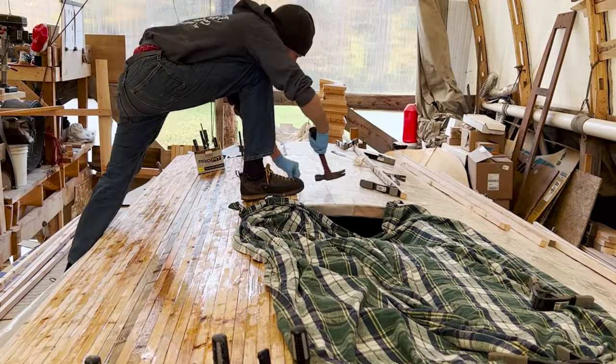Now that it's all kicked off and warm in here, we'll fair the top, flip it over, fair the underneath, and we'll fit it and fiberglass over it. Because of the prep being flat, flat, flat, it made the process of gluing up yesterday pretty straightforward. Oh, good. Okay. No, the glue up itself was easy. Yeah. The temperature right now, that's our biggest challenge.